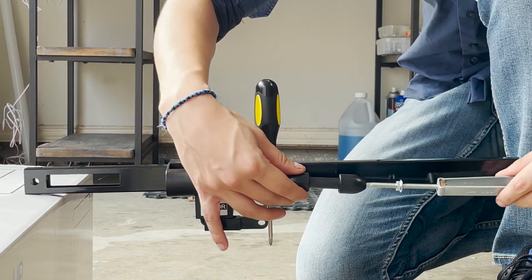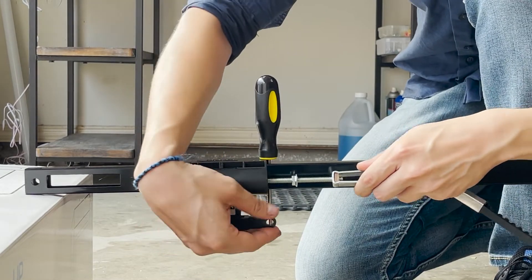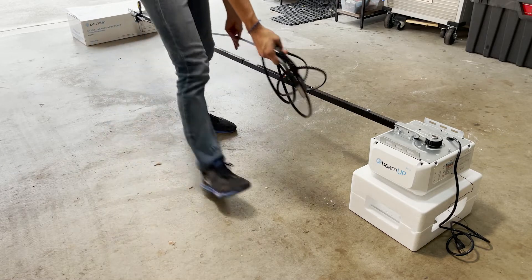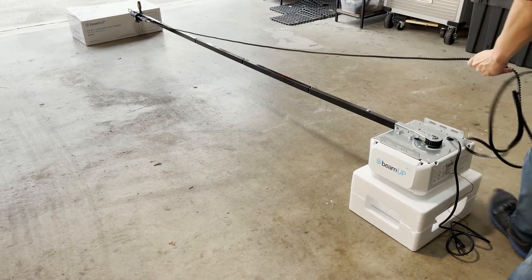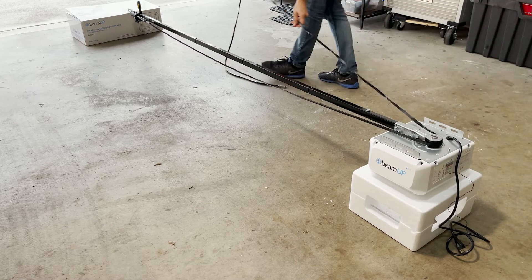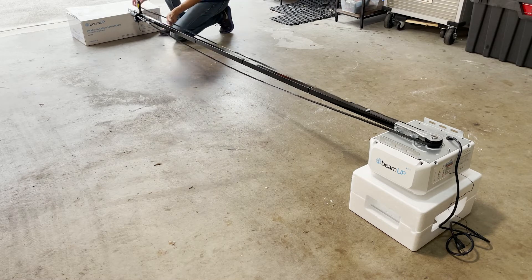Find the trolley shaft and belt assembly. Insert the trolley shaft into the trolley and lock it in place. Pull the belt along the rail towards the power head. Loop the belt around the belt sprocket. Both the sprocket teeth and pulley must engage with the ribbed side of the belt. Pull the belt through the slot at the end of the rail and fasten to the trolley shaft with a master link.